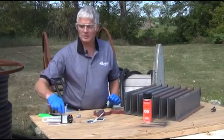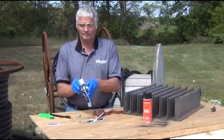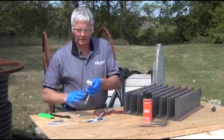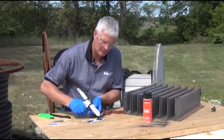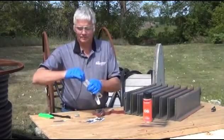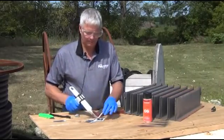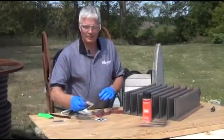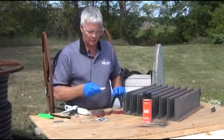To use the Power Patch, put the cartridge into the tool and close it. Then prime it, making sure that both the black and white resin are coming out. Place on the static mixer and prime the static mixer — about one pump. Right before you apply the final permanent seal, clean the area once more with another TR solvent wipe.